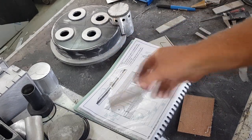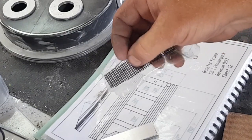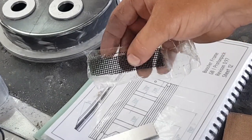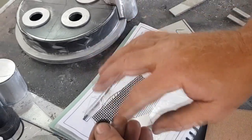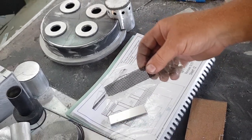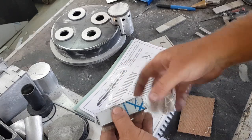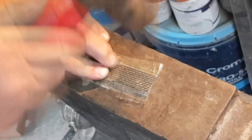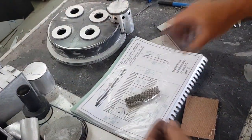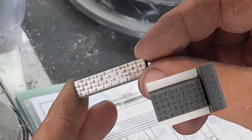But then what I came up with is this. This is some industrial fly screen mesh — that security fly screen mesh stuff. It is basically a fly screen that's made out of a much thicker stainless steel wire by comparison, and it has exactly the sort of crosshatch pattern that you need to transfer into the metal. By just putting it onto a piece and taping it down to hold it in place, I can then give that a pretty good whack with a hammer and it transfers that pattern directly into the metal, giving us those little pieces with exactly that crosshatch brick sort of pattern we're looking for.